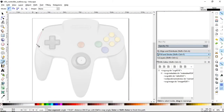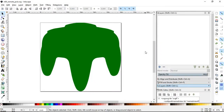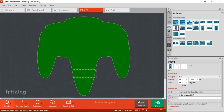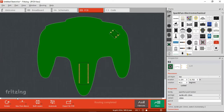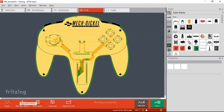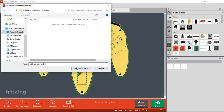The work started by making the shapefile for the PCB using Inkscape. With Fritzing, I used that file made with Inkscape as the basis for the PCB project. I arranged all the parts on the board, and with the PCB project complete, I exported the Gerber files to send to the PCB manufacturer.